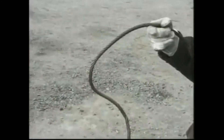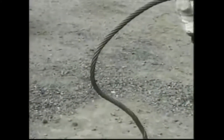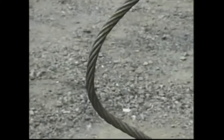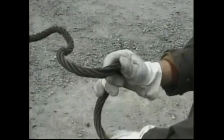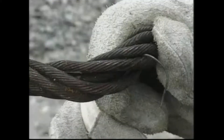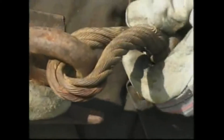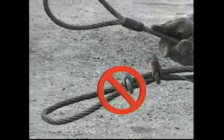A dog leg can be used as long as the wire strands haven't been moved, cut, or dislodged. This rope is not acceptable because the strands have been displaced. Pay special attention to the rope's pickup points and terminations — those are the sections of rope most likely to fail.